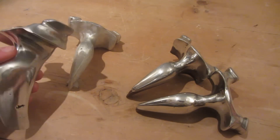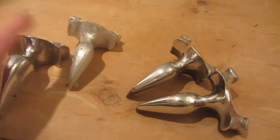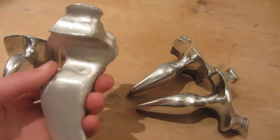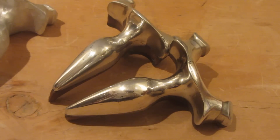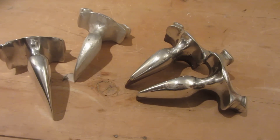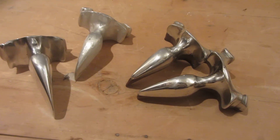Much more accurate ways of casting include lost foam casting — that's how I made this slingshot — and there'll be a future video on that. There'll also be a link in the description to my aluminium casting playlist. You can also make a green sand cast slingshot, which is currently unfinished, but once it's done there'll be a video on both how to make the green sand and the slingshot. But if you want really easy, quick moulds that require almost no tools — basically just wet beach sand or play sand — then this is the casting method for you. You will need to spend a bit more time finishing up after casting, but you save a lot of time on mould making.